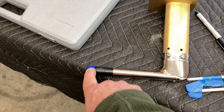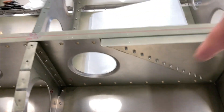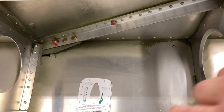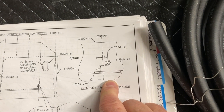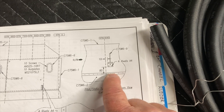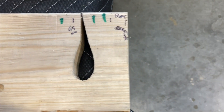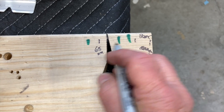I'm going to figure out exactly how far this goes out because these are different. I've measured out — I'll show you. The connection to the strut is right about here. I don't want it underneath the strut, so I'm putting it in the bay right about here. The plans show that from the center out is 80 millimeters, so I minus half that and that makes it 65 millimeters out. That's where I'm starting on my little bracket.